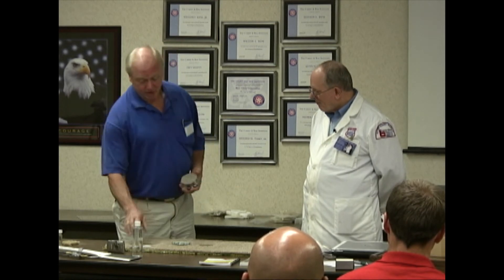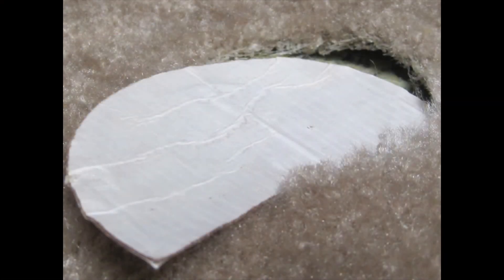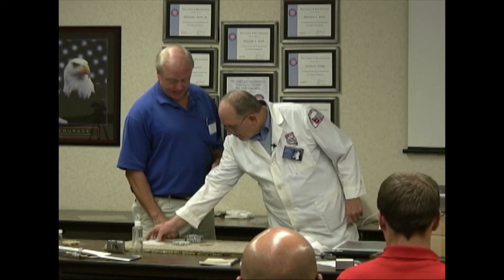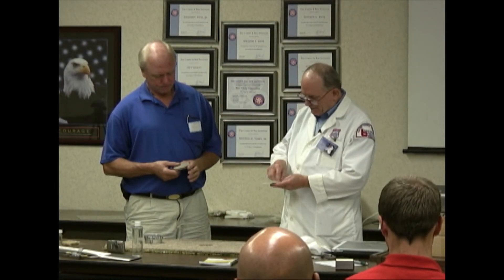Customers sometimes volunteer that they've got a piece out in the garage — great, let's go look at it. You might have to clean it first, but the match might really be good after you do that. Now, are you going to be able to clean it and plug it the same day? Nope. With pressure-sensitive tape — that's what comes with the kit — you place it underneath and peel it back. I use the iron because I know it's never going to come out even under a cleaning circumstance. With tape you might get a little pucker at the edges. Use a seam seal too. This piece is bigger than the hole so you open it up, twist it around so it sits right on the pad, and the old carpet sticks to the underside. Then when he puts his plug in, it glues to the rest.